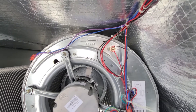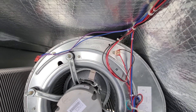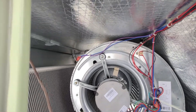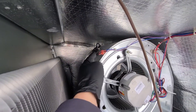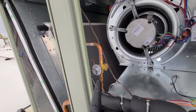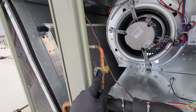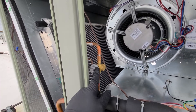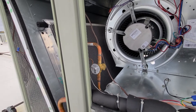Your speed taps are listed right here on this data tag. Up here we have one of your high limit switches that can trip and cut out your heat if something isn't working correctly. We also have a mixed air sensor up there. Right here we have our TXV for air conditioning — that's just our metering device in the refrigerant circuit to meter the refrigerant.